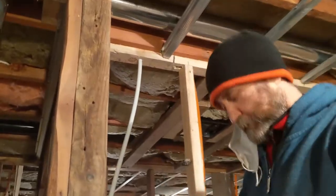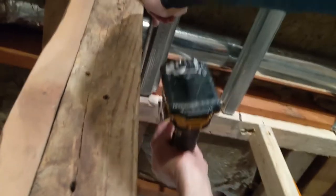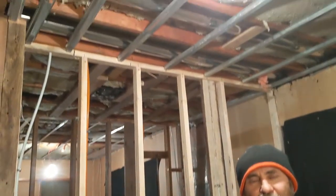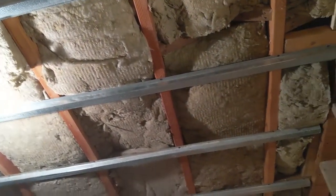Here on this corner I need the backing — I'm just gonna grab one of these pieces. Even if it's a little bit longer it doesn't matter much. All you want is to have some backing here for the drywall, and we've done this room. Like you guys can see, nice and easy — very much you can improve the quality of the sound and prevent the noise from your house quite a bit with this material. It's not like 100% soundproof because sound is very hard to eliminate, but we can reduce quite a bit of the steps from upstairs.